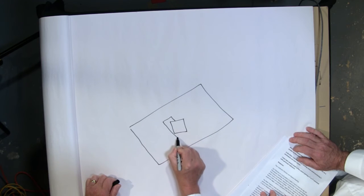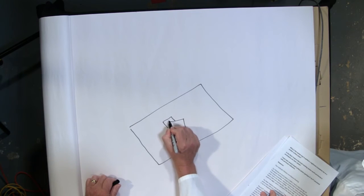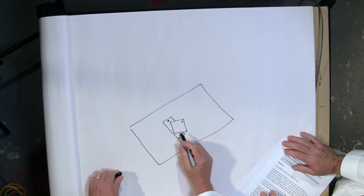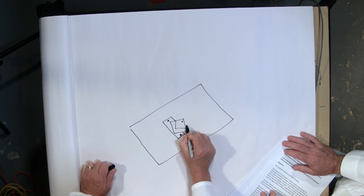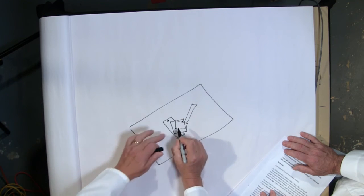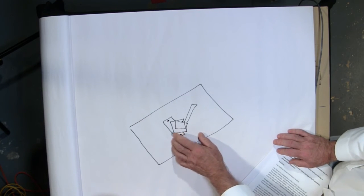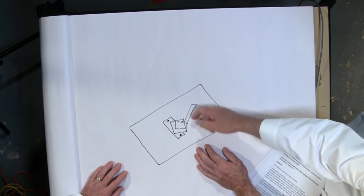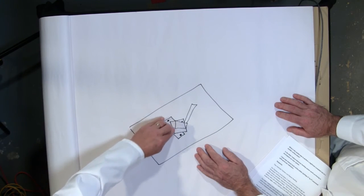Now you'll know why I'm a calibration owner, not an artist. These are leveling knobs, and I believe this is a fixed reference. So we will set their base. How am I going to draw this? Their base is going to set on here, and that's the pole that holds the indicator. It's going to set on there, and we're going to level it to 3 points. So you've got your leveling plate on top of your surface plate, and theirs on top of it, and then you have your indicator that you just sweep across. Our indicator is going to ride on our plate, and we're going to approach it from different angles. Okay.